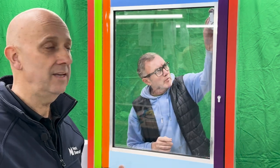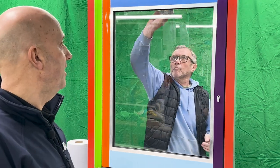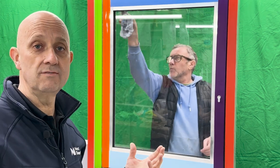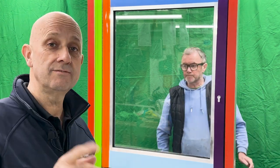Pretty simple stuff really — anybody can do this, it's very easy. Then, before the film goes on, we want the film to go on wet. So we're going to spray a good coat of diluted fairy liquid onto the glass again so that it has a nice even coat of soapy water onto the glass, ready to accept the film. We'll show you how to fit that next.